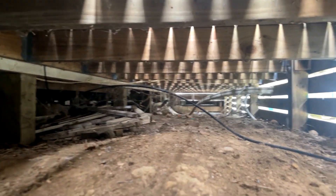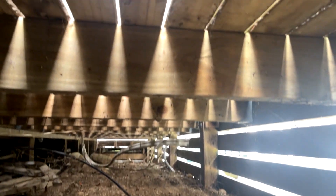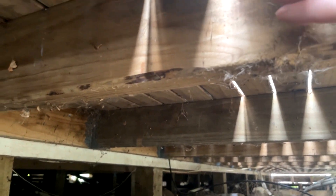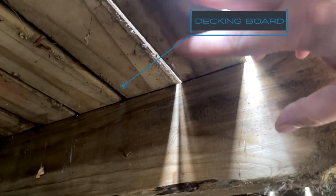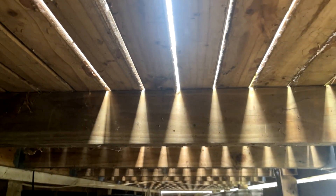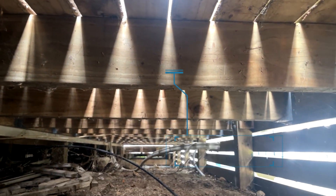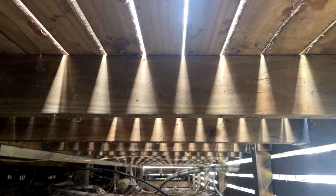The spacing of these would be approximately 1.8 meters apart, and then the last thing that goes on is a decking board. The spacing of the joists is all dependent on the thickness of the decking board. These ones are a thicker decking board, and therefore the joists are spaced at 60 centimeters. If the boards were a thinner 19mm thick board, then the joists would be at a 45 centimeter spacing — closer together.